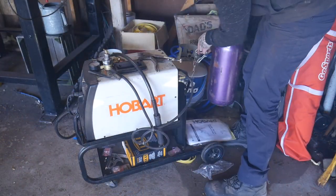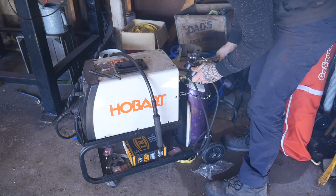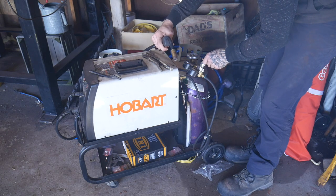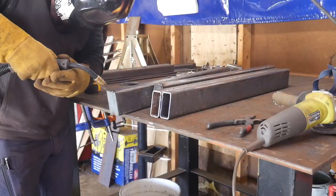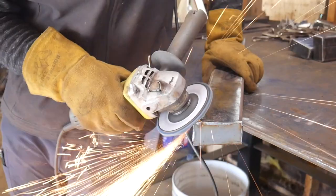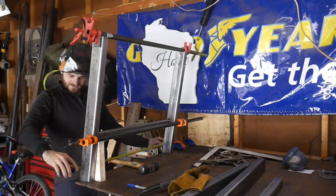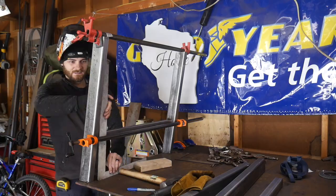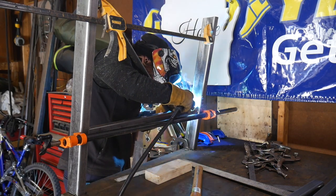We are starting this build with a fresh tank. The welder I use I got for about $700 used on the marketplace with the tank — I have no affiliation with Hobart, just showing my setup. It's a simple Hobart Handler 190. To start welding we're just gonna cap off these ends with an inch and a half flat stock and then grind it all smooth. My welding setup is relatively basic — the table from marketplace wasn't that flat, which is my biggest struggle. I don't have any fixtures so just making do. Constantly checking square as you weld and jumping around so you don't pour too much heat in one area.